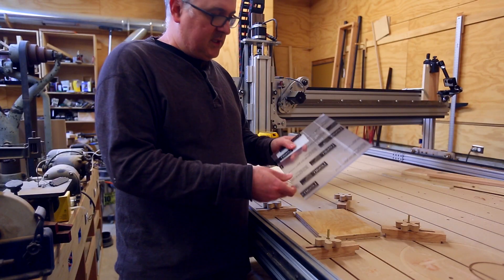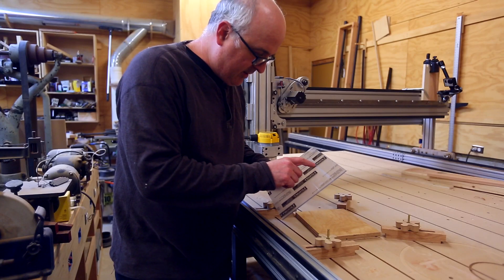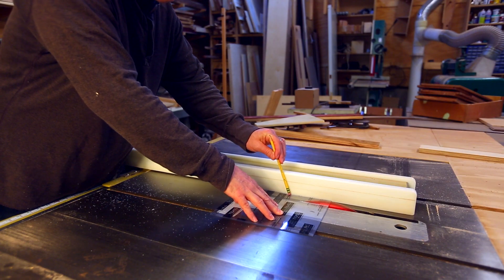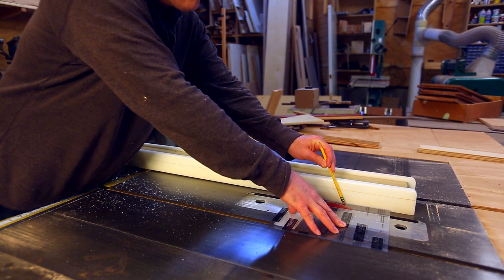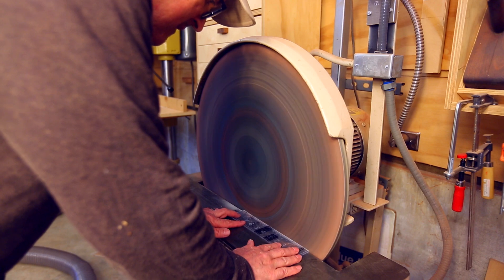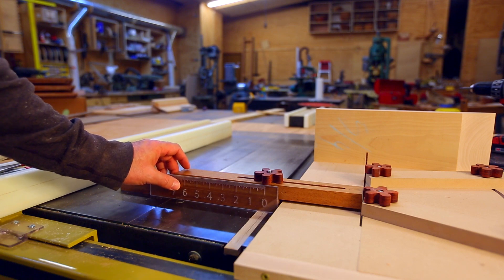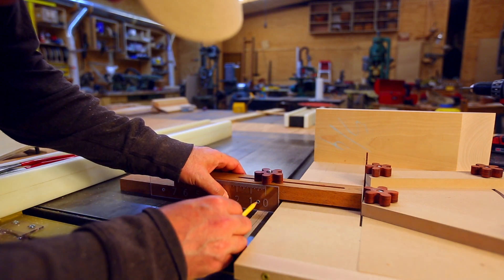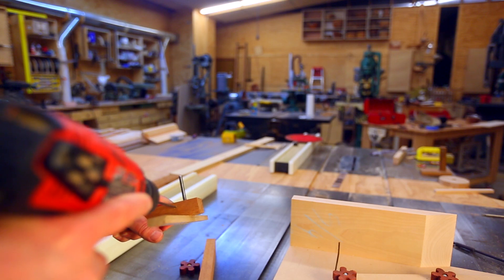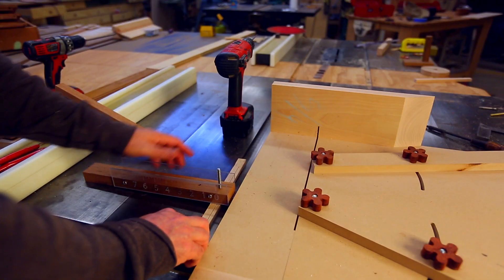It took a lot of testing to get the CNC tip to the right depth — not so much exactly right but a good depth so my engraved lines didn't all run together. The gauge wasn't going to fit for a CNC cutout since I didn't have a way to hold it, so I just cut it on the table saw and sanded the edges. You can see how it goes onto the stop — it attaches to the bottom piece, allowing the top piece to still move alongside the gauge.